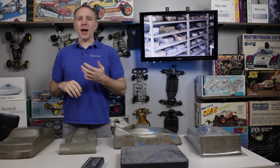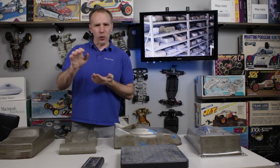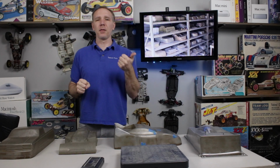Now, the bad side of doing it the way you see on YouTube right now with the plaster is that plaster is softer and it will be abraded away over time, and you will actually lose your original shape over time. The benefit of the plaster is that you can repair it fairly easily.